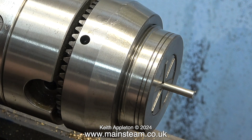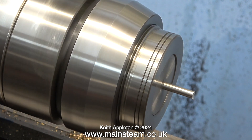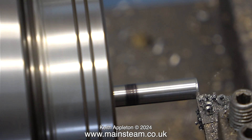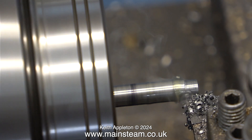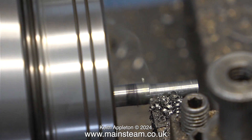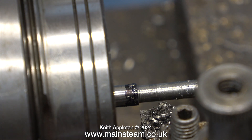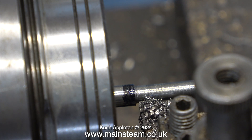In this video are some previews of what I'm going to be doing. I would always use this collet chuck for making axles because, apart from being accurate, if you remove the axle to try it in place and put it back in the collet, it's perfectly concentric — quite unlike a three-jaw or even a four-jaw self-centering chuck. I'm actually making a piston rod; first of all I took a test cut, followed by applying some cutting oil and then turning it all the way down. I need two BA threads of different lengths at each end of this piece of stainless steel. The marking out as usual is a little bit haphazard — as long as I don't cut any further than the end of the thick felt tip pen line it will be fine.